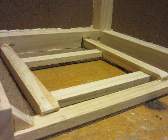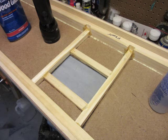For the things like the handles especially, I'll use a slightly thicker stick of scrap wood and use a milling bit and a Dremel tool to kind of auger out a bit of the rails so these wooden strips can be recessed in a little bit. Therefore, it's not just the glue, and when you pull on it, the actual weight of the case is taken up by the wooden strips and not by the masonite itself.